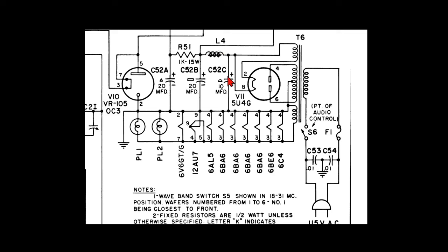So the first capacitor is 10, and you might say, well, gee, that's kind of small. I could stick a big one in there and get better filtering. Well, that would make for a very unhappy inductor here. And let me explain why. A transformer is a device that prefers to deal with AC. So coming out of the rectifier, your rectified DC has got a significant amount of ripple to it.